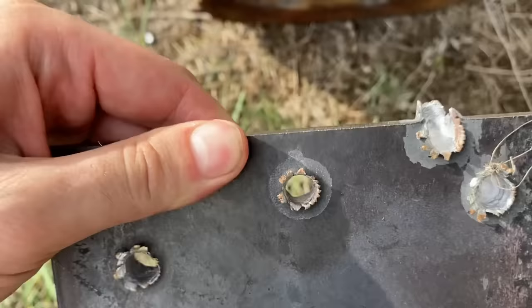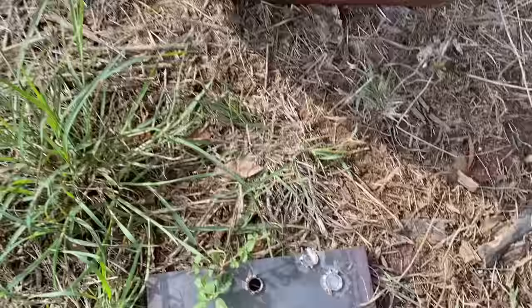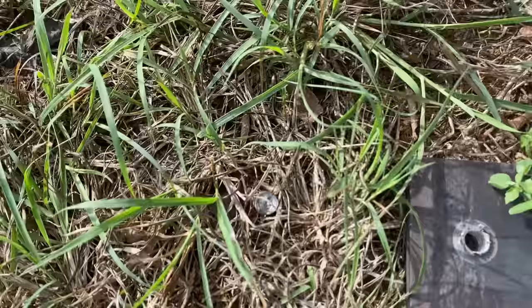Now you may be thinking 0.302 inches is nowhere near 3/8 of an inch — but what I found on mild steel plates is that if a bullet penetrates a certain depth and has enough leftover energy, rather than doing a clean pass-through it'll actually shear out the back of the plate making a little steel cup, which you may have seen in one of my previous videos. But if the mild steel plate is big enough to absorb all of that energy, then you're just seeing straight penetration rather than a shear-through. Anyway, I really hope that you enjoyed today's video. Thanks so much for watching, and remember: don't let ballistics drive you bananas. I'll see you in the next video.